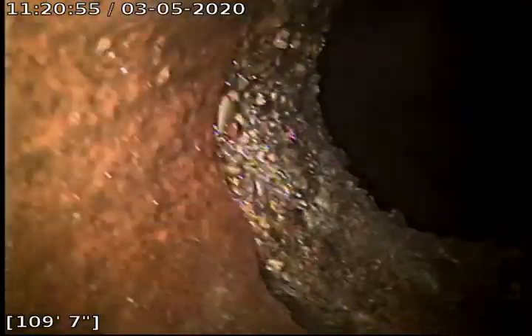This line is approximately 110.7 feet from this clean out I'm working at in the laundry room. Start pulling back into a 4-inch clay tile. This section is the stub in from the city.